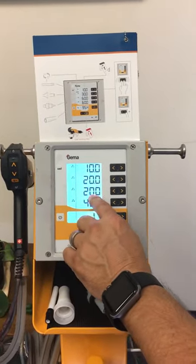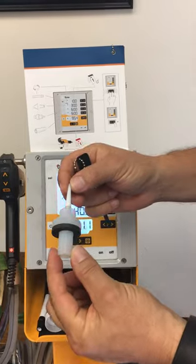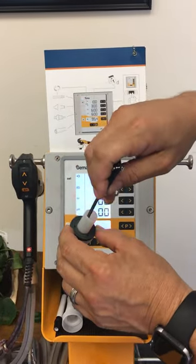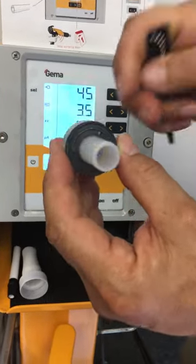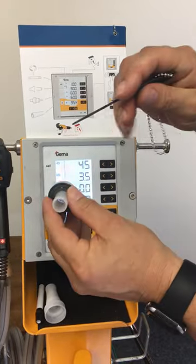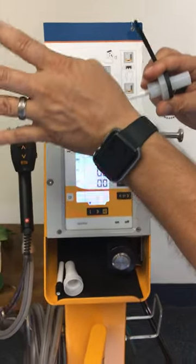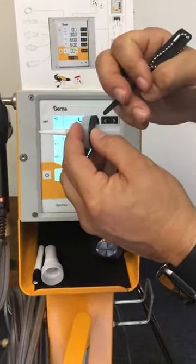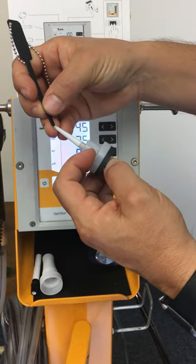The electrode wears out in two different ways — electrically or mechanically. The mechanical wear happens down inside where powder runs across a small wedge. When it wears mechanically it'll wear out like a sawtooth, producing a finger-pattern out the end, or it'll wear like a half-moon shape inside, directing powder inward and causing a more directional, narrower pattern. Electrically, you test it by placing a contact on each end with a mega-ohm meter — you should get around 28 mega-ohms of resistance. That's how you know if it's electrically good.